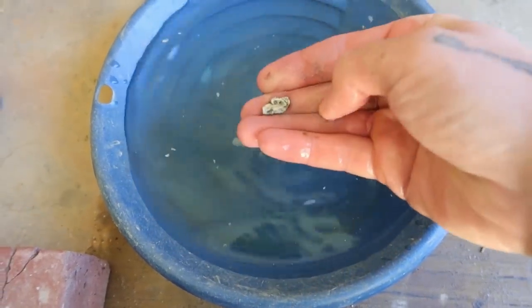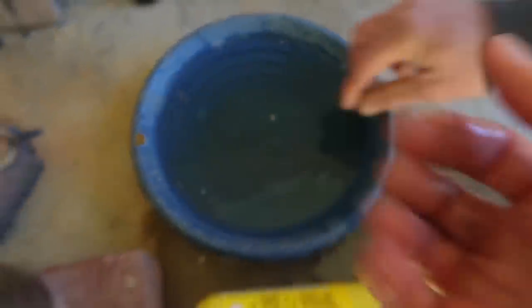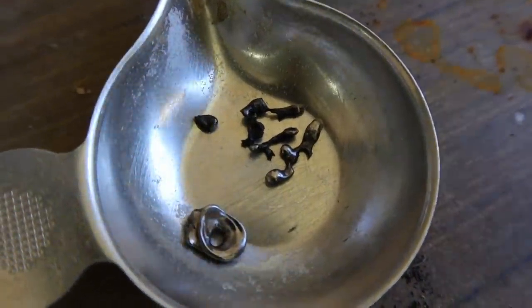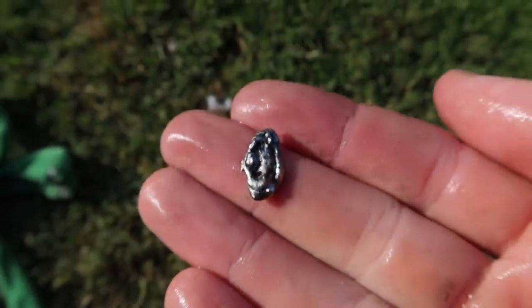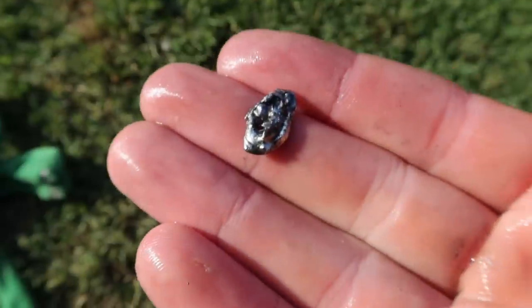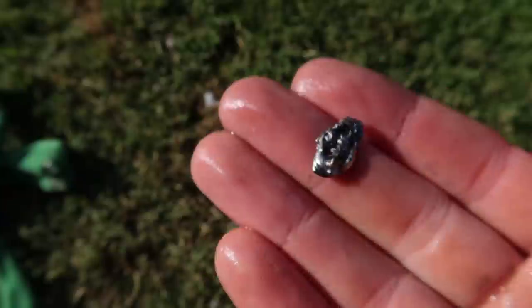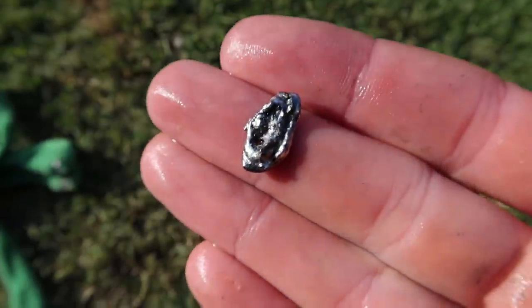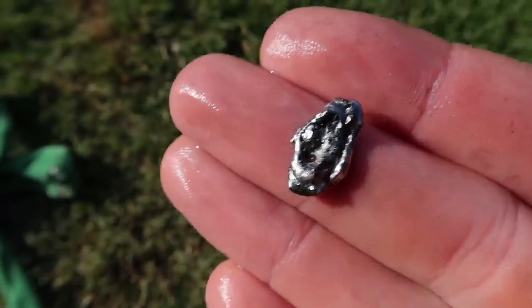I have done a grand total of only five smelts in my entire life, and my accuracy of pouring into a mold even one this big is not great, so we decided to eventually pour into water. The silver color of the gold that we poured out is due to impurities contained within the smelt. The sulfides contain a high level of silver and lead, and these are really good at absorbing precious metals such as gold - when you smelt they mix together and end up looking like this. It's a pretty simple remedy: you just need to add an oxidizing agent, which helps turn those impurities into slag and they literally break away from the gold.